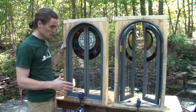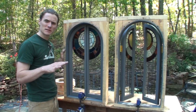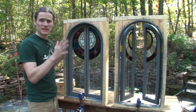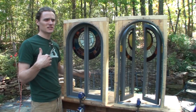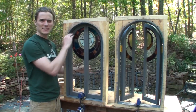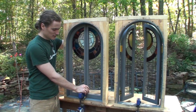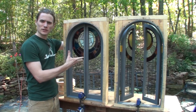The construction is pretty basic on these windows. The outside frame is made of two-by-fours. I just made sure the two-by-fours I picked were as straight as possible with a grain orientation that looked stable in the long run — not being too picky, just try your best. A window like this that's hinging has gaps around it allowing enough tolerance for things to shift a little bit. Plus the way you'll end up keeping the windows closed will probably pull things into shape while shut, making for a good seal.